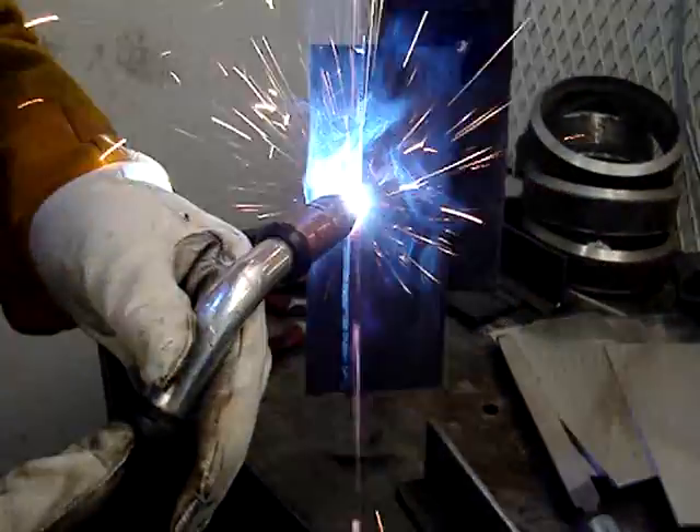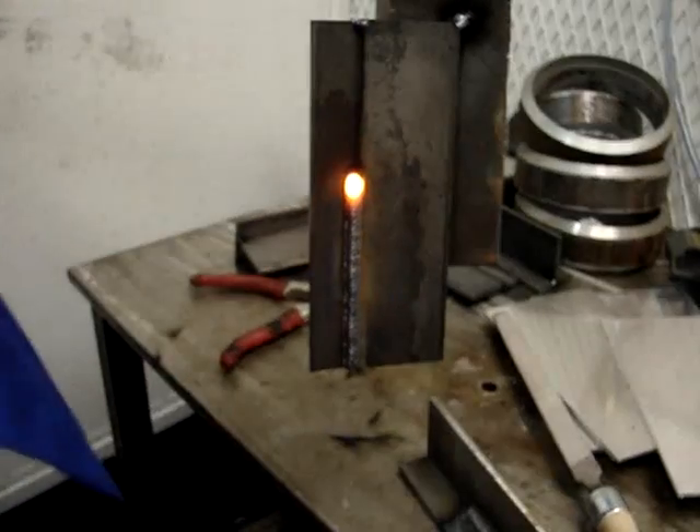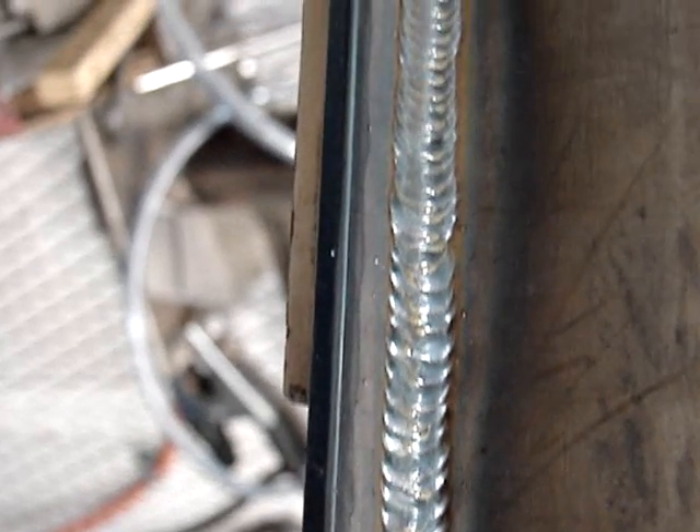Then we change gears and go to the triangle — a series of triangles — same thing, cutting that arc into the front edge of the puddle, just watching that right side and nipping the corner. We're using roughly around 18 volts and 200 inches per minute of wire feed speed, 0.035 wire, L56 wire, E70 S6, with 75/25 gas.